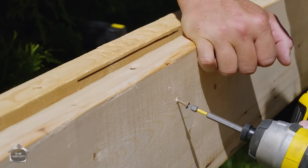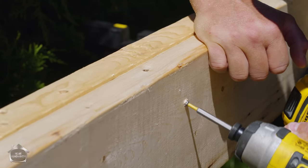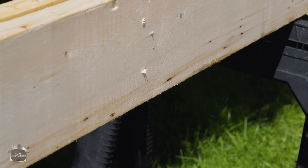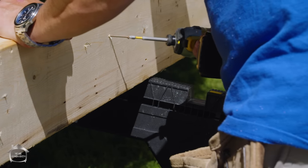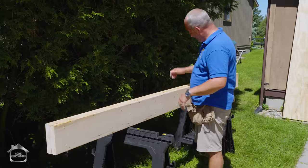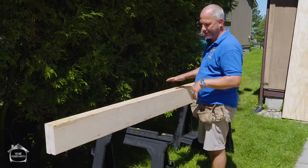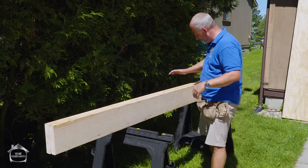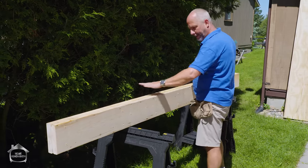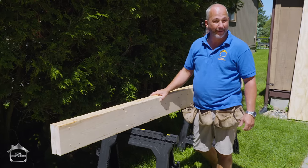Now I've made contact — I'll do this slow. We're just going to tack this together in a few spots. It's still protruding a little bit, and I'm not happy with that because I'm putting a roof structure on it — I want it flat. I'm going to install it for today so we can move forward, and next time I come in I'll bring my hand planer and clean this up a little bit before I put any interior wood in there for the roof.